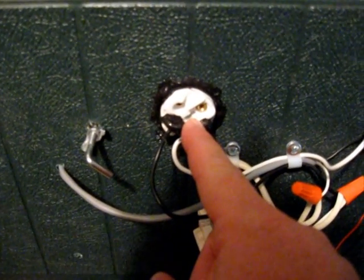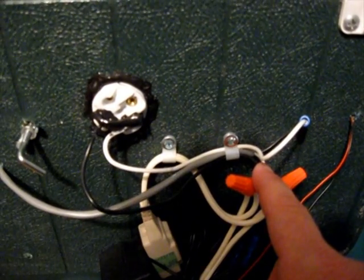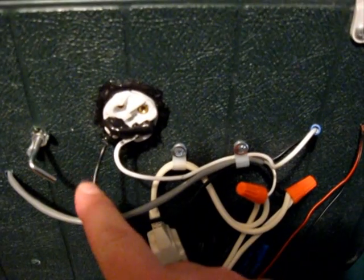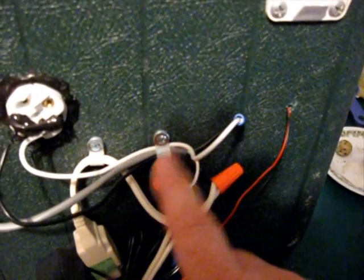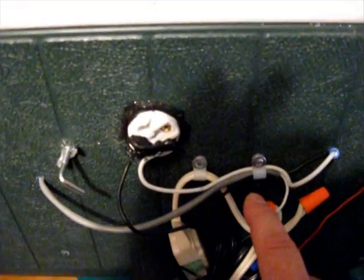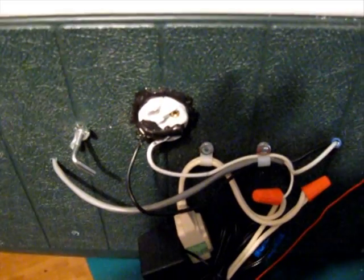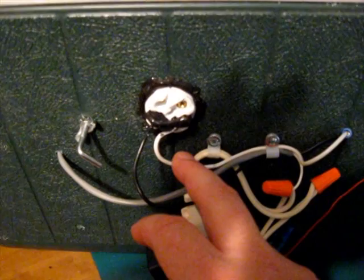You've got one side of your bulb going directly to the plug. The other side routes out from the bulb socket, routes into the thermostat, and the other wire back out to complete the circuit. That's about as simple as I can explain it, because it's not really complicated — but it really seems to bite a lot of folks whenever they try to wire up the bulb and the thermostat. I hope that helps, guys.